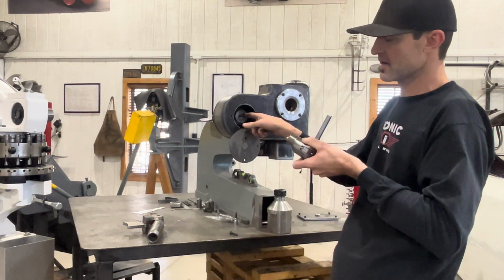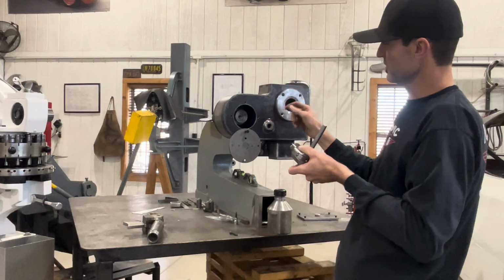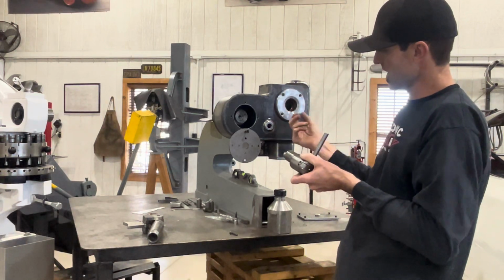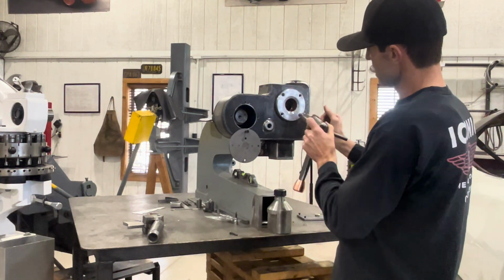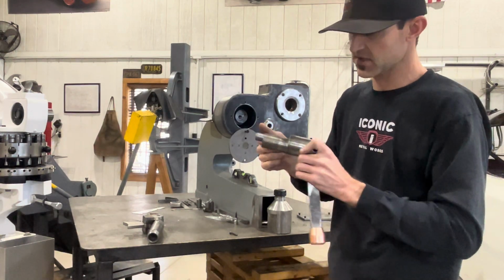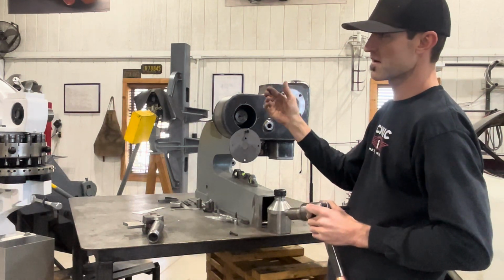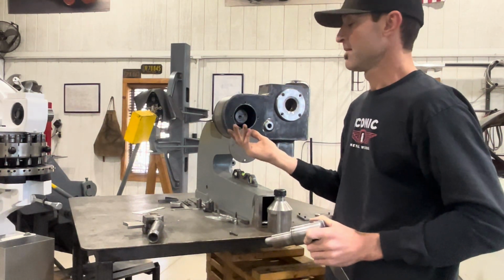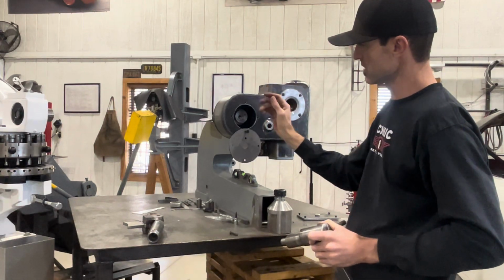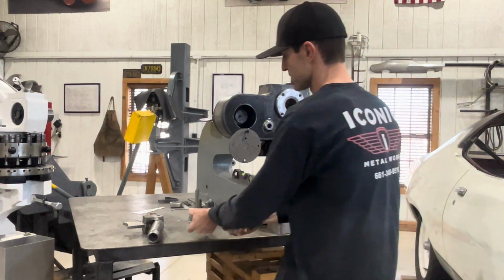I'm 400 thousandths offset on my cam, so as you pull it over here, you're basically lengthening that pull. So it's going to be, say, roughly a little over a 1/2 inch throw, and then as you start bringing it back in, which is down here, which is pretty close to 0. It's dead nut, so you're at 400, and then as you bring it closer, it's going to move the center point of that cradle over here. So it's going to take your 400 and subtract, so you're going to be beaten at, like I said, your 100 thousandths. It's going to move it closer, so out of your 400, that thing's only moving about 100 thousandths. And obviously there's some other geometry involved as well.